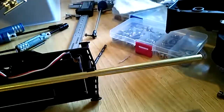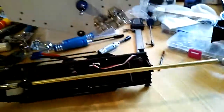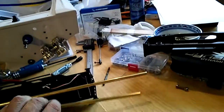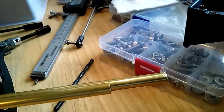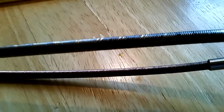Moving on — the upgraded shaft and stuffing tube, both together, because I'll show you why. This is the new stuffing tube, and if you look, this is the old tube. There's a difference in diameter and a significant difference in length as well. This is a slightly bigger diameter and longer. Here are the two shafts together — that's the standard shaft, and the upgraded shaft. Quite a difference.